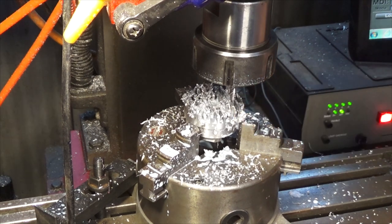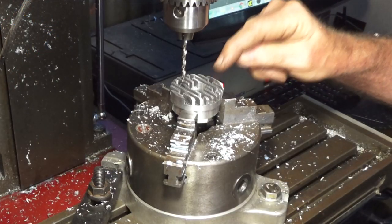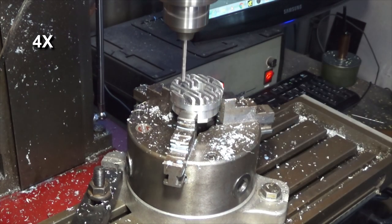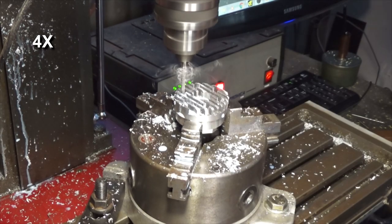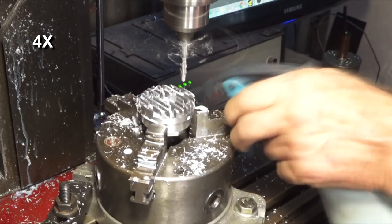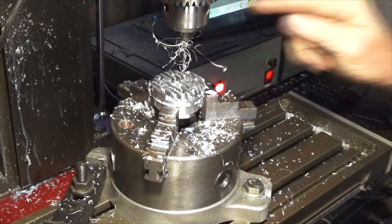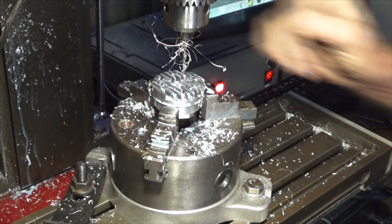It was a bit funky when cutting through the fins but it smoothed out when it got into the solid metal underneath. I did each hole with a spot drill off camera. So now we can drill right through to number 28 and it'll go down into the fixture past the bottom of the cylinder head flange. Apart from deburring, that's the top of the head finished. I'll get it out of the chuck and then we'll do the cylinder liner — or at least the cooling fins on the cylinder liner.